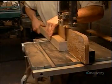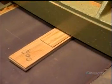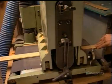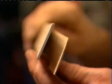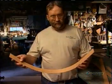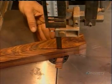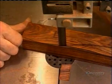been very impressed. To make a longbow, a craftsman cuts 6 strips of cherry wood a little more than ½ centimeter thick using a bandsaw. Then with a belt sander, he repeatedly thins the wood strips on both sides, tapering the ends a little each time. The tapering gives the wood some flexibility, which the bow will need to launch arrows into the air. With his bandsaw, he now carves a handle from a piece of wood.